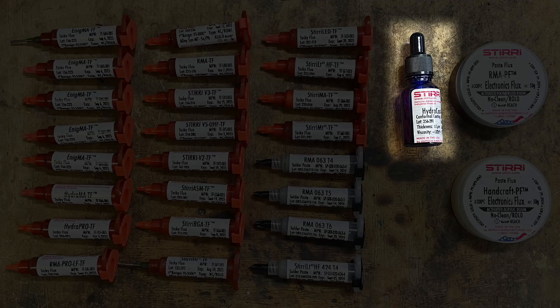There is also a conformal coating which you can apply to circuits to protect them. Not everyone has the same requirements, but these are the things I look for in a flux. Viscosity: the flux needs to be thick enough that it doesn't just flow away, but not so thick that it's hard to clean off. Clarity: when I apply flux to the pins of an IC, I like to be able to see the pins under the flux, so I don't like it too opaque.